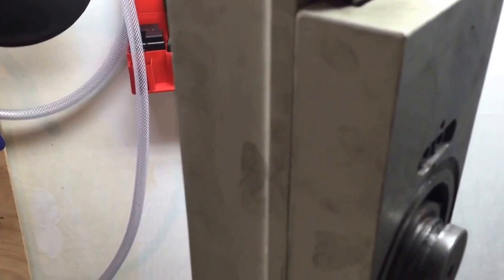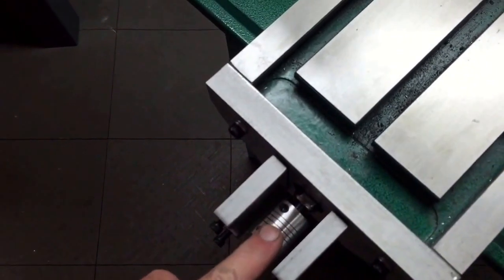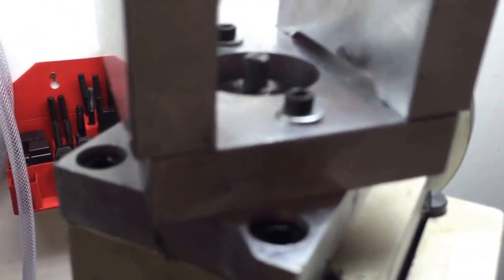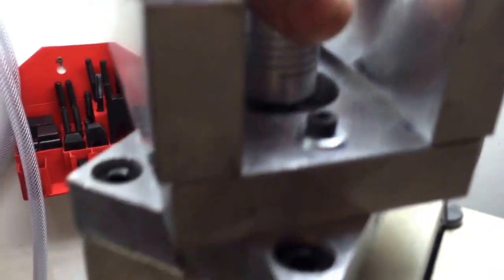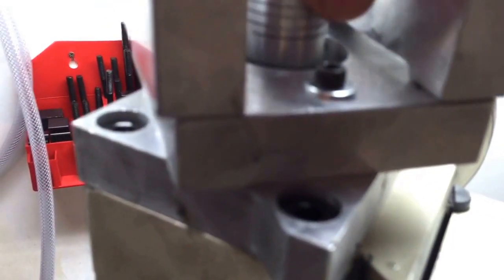I'll take a closer look at it. I bet it's that set screw that's in there - I want to loosen that set screw and try it again. On closer examination, the X and Y did not have set screws in the coupler, but the Z did, which is sort of weird. There's no flat machined into the spindle, so I don't see what the set screw is going to buy me. I guess another clamping point if it's a tougher pull.